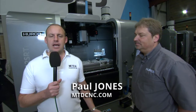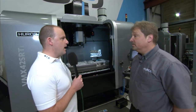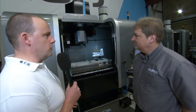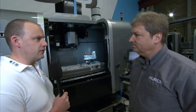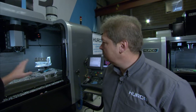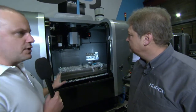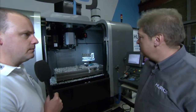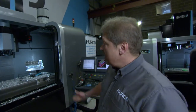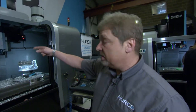There are lots of options when looking to invest in 5-axis technology. Standing in front of one of the latest Hurco 5-axis machining centres, the VMX42 SRTi is a little different to other machines on the market. It has a C-axis integrated into the table and a B-axis head, which gives you the versatility to use it like a conventional 3-axis machine with a larger table size for larger components, but also to utilize the C-axis with smaller components with the tilting B-axis.